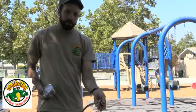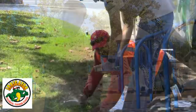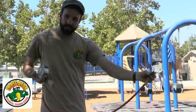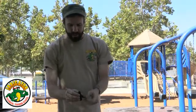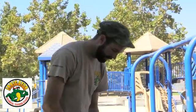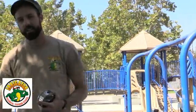For the attachment on here, we have what we call a pitot tube. You put this right inside the tip of the nozzle, and as you hold it there, the water pushing in will give us a reading on the gauge. A nice long hose like this works really well. Also for our pop-ups, we have a T — this is a Hunter T, you can get them at any distributor. You take off the nozzle, screw this into the pop-up, put the nozzle on top, and plug in your gauge on the side. Since our system right now has rotors, we're going to go ahead and use this gauge.